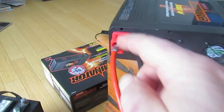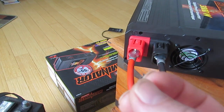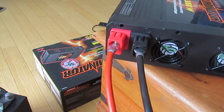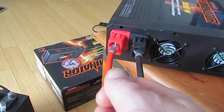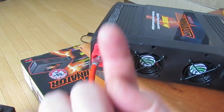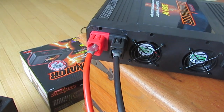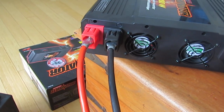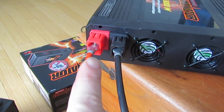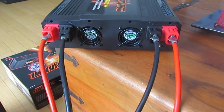When connecting them, pull the guard out and put it on. It comes with nuts on the posts, so you take the nut off, put the cable over the holes, push the nut through, tighten it at the top. You can hand tighten it or use a little wrench. Once tightened, put the guard back into the inverter. Do that for all four.